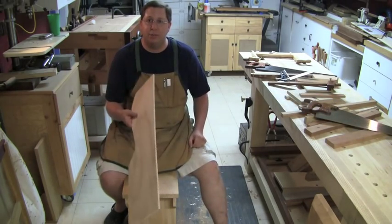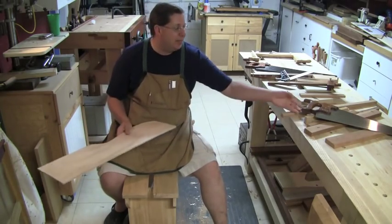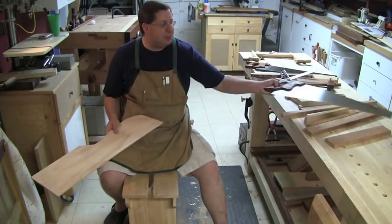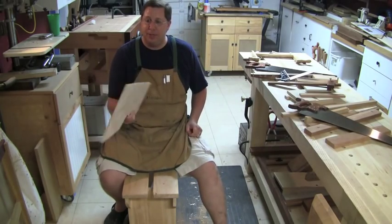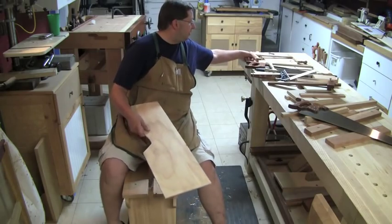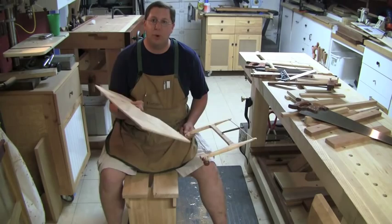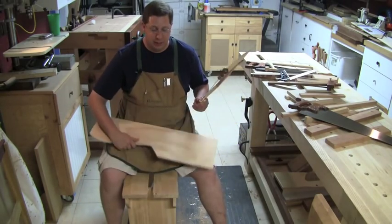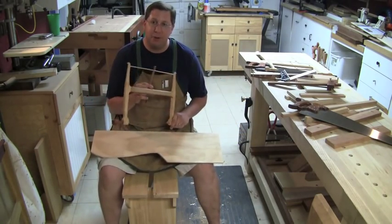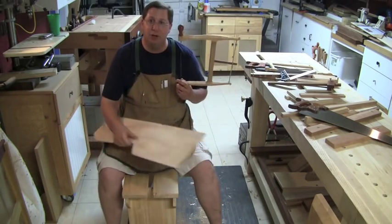The same thing applies with plywood when it comes to ripping. But, you know, there's nothing that says that all hand sawing has to be in a straight line. Clamp this piece of 3/8 inch plywood in a vise or in a bird's mouth fixture. Grab yourself a bow saw. Draw some squiggly lines on the board, preferably something you can repeat on both sides, and go to work cutting some curves.